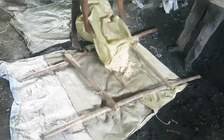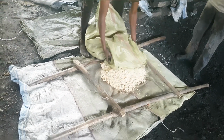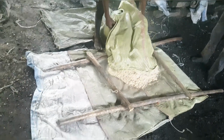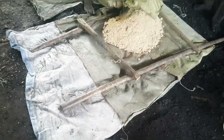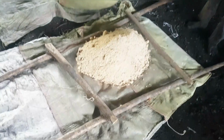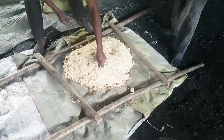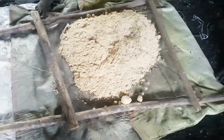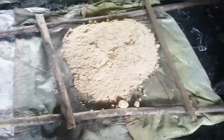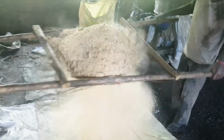So right now this is the sawdust. Still we are going to remove the rough particles, like we've already done in the other videos of briquette making on my channel. We remove the big particles, the rough particles. By the way, I liked this sawdust in that it is very fine. It is almost like in powder form. That's why, guys, I'm going to say this contributes also to the binding of the other materials. It helps in the binding as well, because when it becomes wet, it gets sticky.